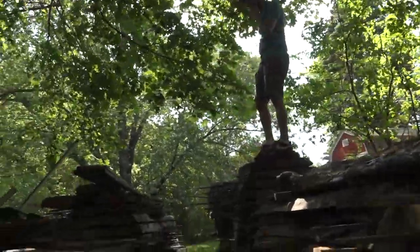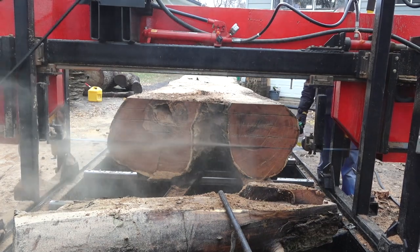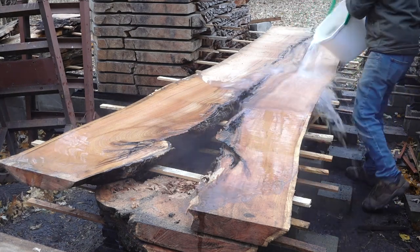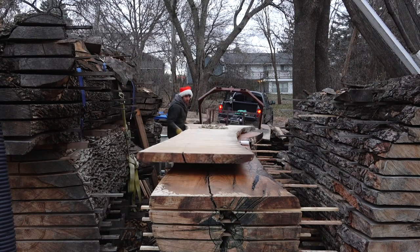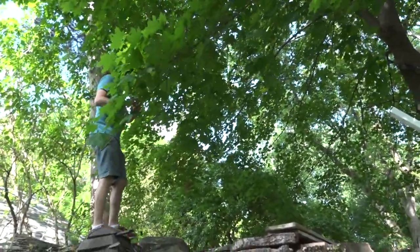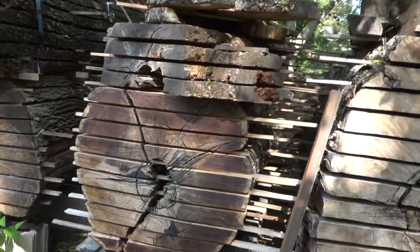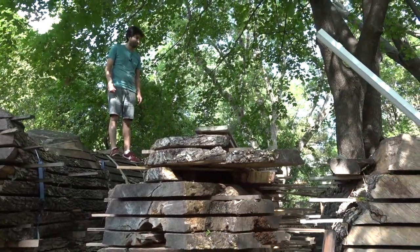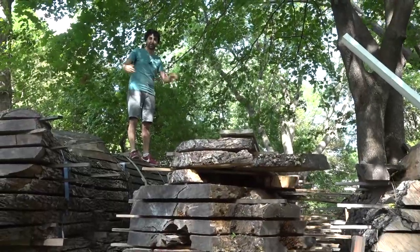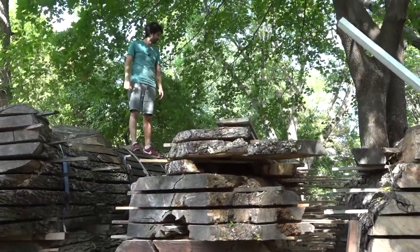Over here, the big one at the bottom is a red oak log that I sawed with my dad over Thanksgiving — it's been out here about six months. That thing is 12 feet long, about four feet and change at the crotch, and about three feet at the butt. It was a lot of fun sawing slabs with my dad over Thanksgiving weekend. It's got splits with dirt in them, giving interesting grain and color, and some really big slabs — most of the bigger ones weigh about 400 to 500 pounds wet. They're currently at about 30% moisture, so I'm just starting to get readings with my moisture meter on those.